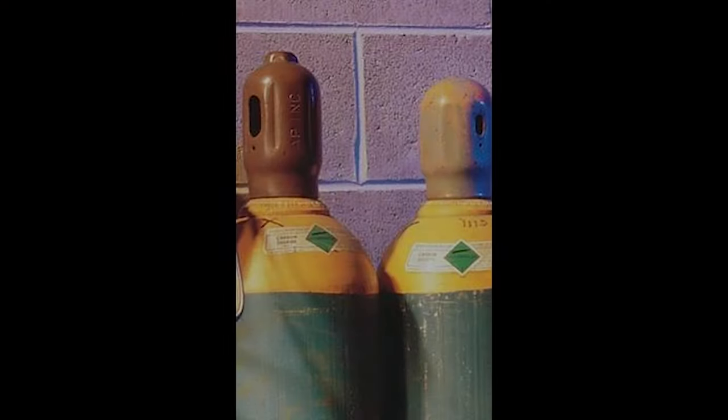Workers must watch how they hold onto a cylinder when moving it, because cap holes — which are there for ventilation — have caused serious cuts and amputations when employees got their hands in the holes and the cylinder fell. Never reach and grab a falling cylinder, as this could result in amputation, serious cuts, or back injury. Additionally, under PPE, employers who have employees handling cylinders regularly should consider requiring steel-toed shoes with metatarsal guards to protect against serious foot injuries from a cylinder strike.